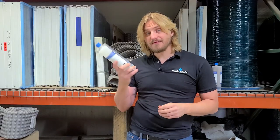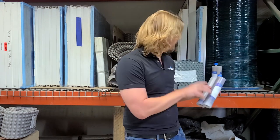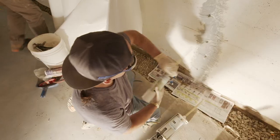On top of that, it's not very strong. They use it because it's easy. It expands and it expands and it expands, where the epoxy does not. And because it expands, you don't need to get a good enough seal on the crack. You don't need to do as well of a job in order to fill the whole thing up. So it's easier to train technicians, you can pay them less, and so they like to do that because they see it as making more money. We see it as a lesser repair because it doesn't hold as long and it usually requires a follow-up repair. So that's why we use the epoxy.